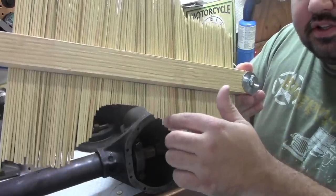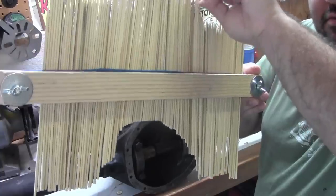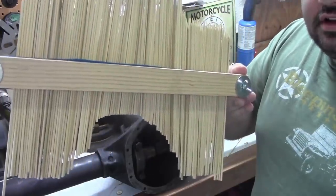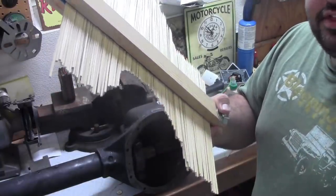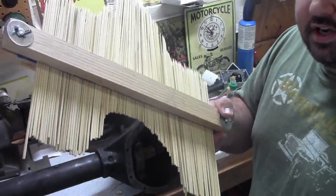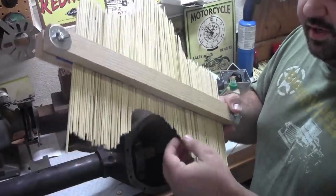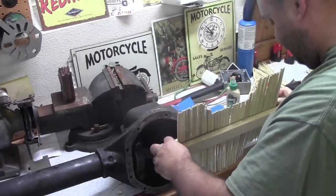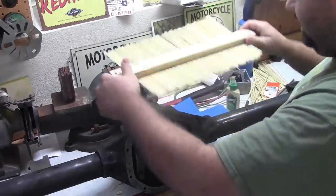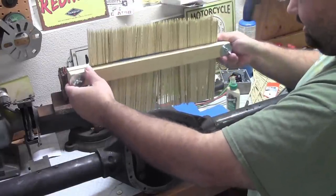Let's try it out on the axle and see if it gives me a good profile. You have to make little adjustments by hand as you're pushing it down — you might have to slide one or two up or down. It's not perfect but that's a pretty nice profile to start with. I could transfer it to cardboard first, fine tune it, and then transfer it to metal. It's pretty quick — you just get your profile and can take measurements in different spots, one up here and one back here.